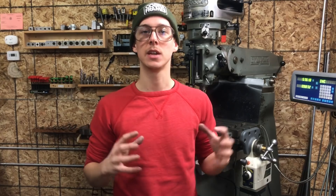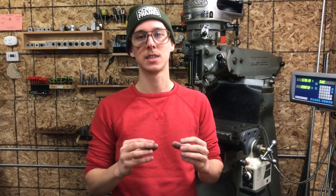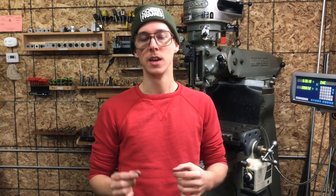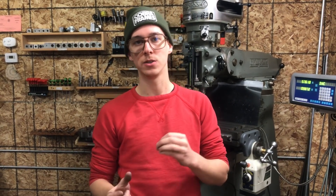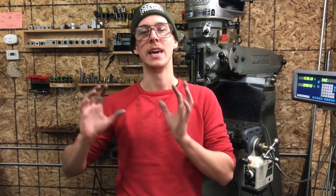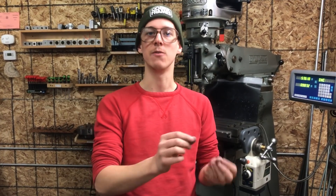It's a hard thing to get good at, and I think it's good to drill the practice joints themselves for a while before you start making whole bike frames. Also, let's say you're trying new pulse settings, a new welder setup, a different kind of filler rod — you maybe don't want to put that right away into the bike frame. You want to do that in a practice joint first so that you can get comfortable with it in a low stakes way, which is a couple dollars into a practice joint.